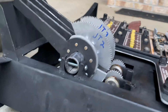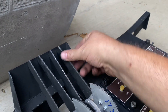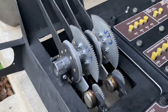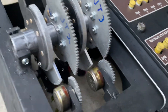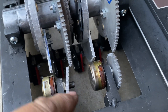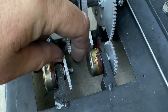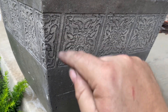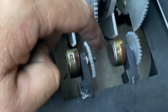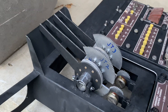There's an additional lever that sticks out to about here — that's the throttle lock. When you move it, it locks them all. When it's time to make the knobs, I'm going to make a silicone mold of a knob and pop resin in there and let it harden. On the back there are two potentiometers. Each potentiometer has a gear and an indexing plate — about a quarter inch aluminum, shaped like a circle with a lip and three surfaces for an indent, so when it moves there's an indent here, here, and on the front.